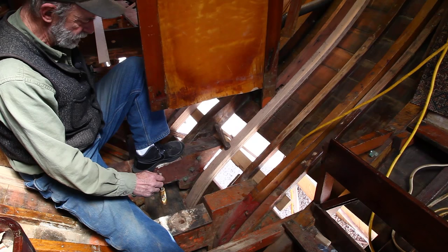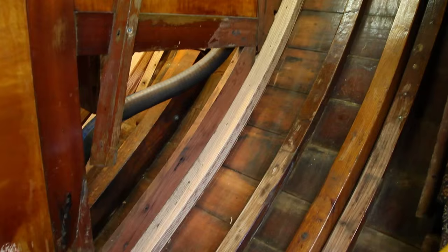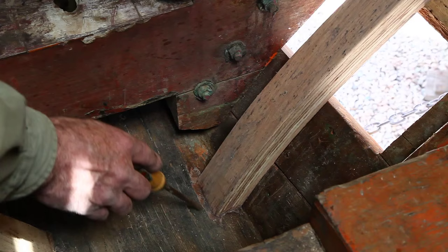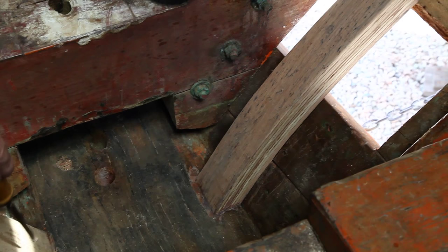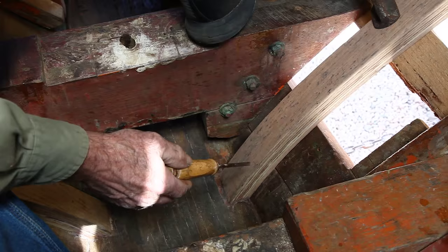We've removed a lot of bolting and accessed this area and removed some interior because we wanted to replace these frames right here. These two are actually down into a pocket that's been cut into the keel by myself, a little bit wider than the original pocket. They had these tapered pockets that were kind of different than I've seen in the United States, but we dug the frame heel out of there, recut the pocket, and we've got the frame snubbed right down into the bottom of that pocket and right up against the deck.